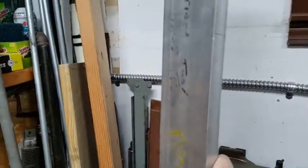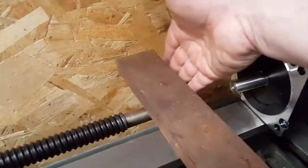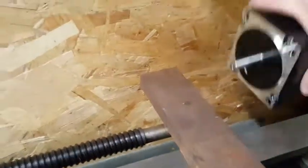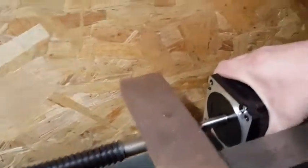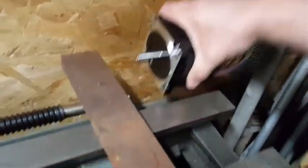I've got some three-quarter by four-inch aluminum. I'm going to cut a chunk of that and mount it to the face of this steel bar, machine it to fit, and then couple the shaft up to that motor — and that will sit right down there like that.